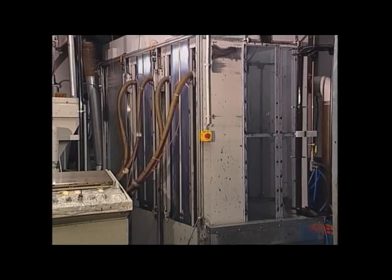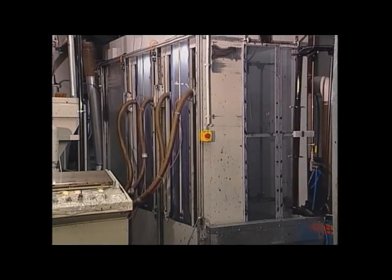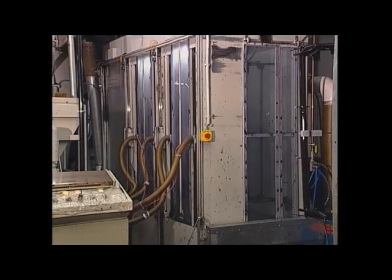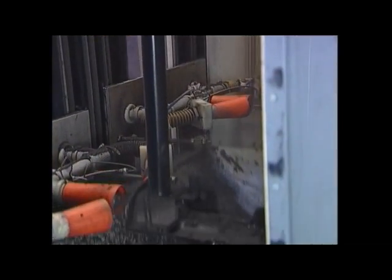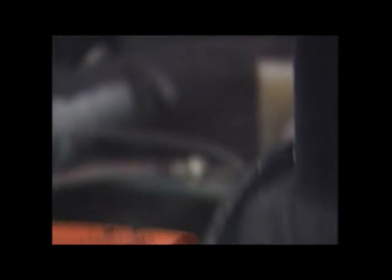In the next cabin the parts are automatically flocked in the same processing cycle. In order to guarantee a high flock pile and a good density of fibers, two groups each with three electrostatic pneumatic flock nozzles run along the entire length of the metal rods. You can clearly see the flock jumping between the nozzles with the high voltage electrodes and the metal rod to be flocked.